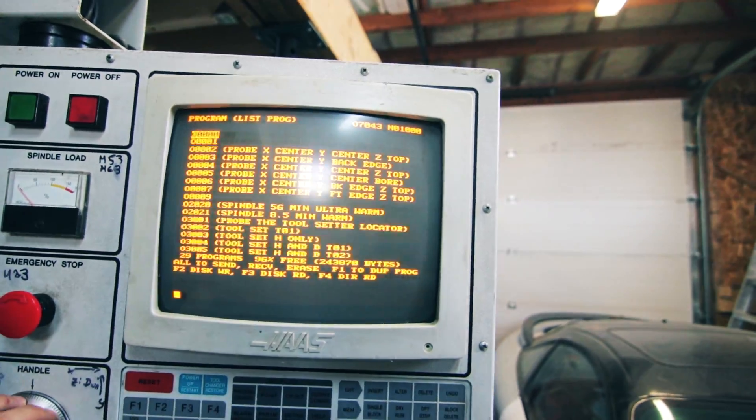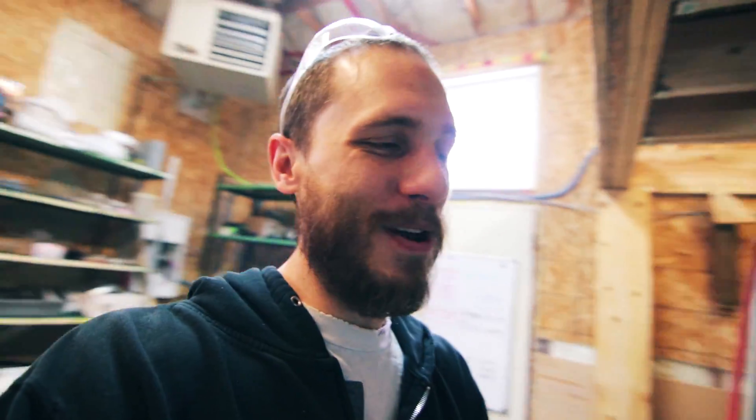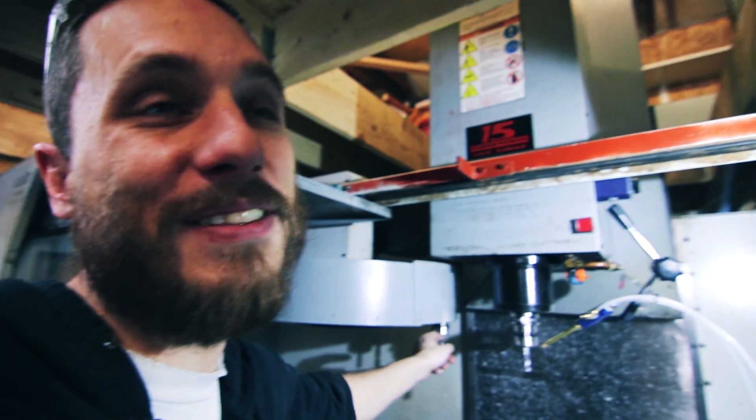Look at all the programs that I've written already. There's my main one right there - operation one, and then I've got a couple sub programs that I run, and then in those subs I've got some local subroutines. I sit and use Fusion 360 and I understand better what each of the G-codes it's putting in are doing. It's been a battle to learn. I've snapped tools - this one's already chipped from smooshing it on the tool setter. It's got one tooth that's not chipped so it's still hogging out that corner. I've broken two of the 7/16 bits - two from being too aggressive and not understanding everything that's going on. No drills broken though, so that's good. I think I've got a pretty good grasp of what's going on.